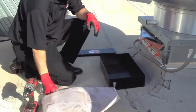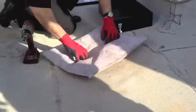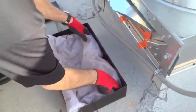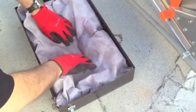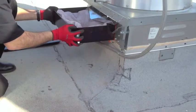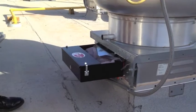What's important about the pillow: you'll notice these things get a little dusty. What he's going to do is work the pillow out nice and flat — we want the media inside of it to be even across it. He's going to set it down inside the rack system and tuck those corners in. The key is he's working a bowl or funnel shape down to the middle of the rack. He's going to make sure everything is good, then snap his lid back in place. Easy enough.